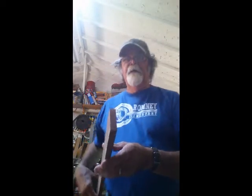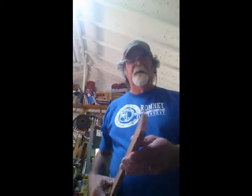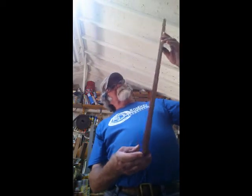I'm in the process of making a fingerboard out of mahogany. I usually start with maybe about a quarter inch thick, because it still has to have thickness in the center when you take the side pieces off for the radius. This piece is probably about 24 inches, and it's just about enough for two fiddle fingerboards. I'm going to show you the step-by-step process that I do to make that.